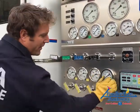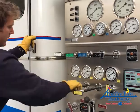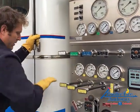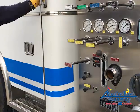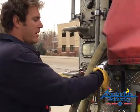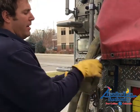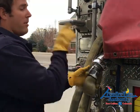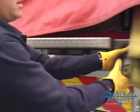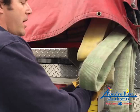The hose reel I'm going to leave closed for the whole operation. Once again, every drain needs a vent or it's not going to drain properly all the way — we really want to get all the water out. We've got all the valves open to all these discharges, so we'll open up the caps to help ensure a complete drain on each one.